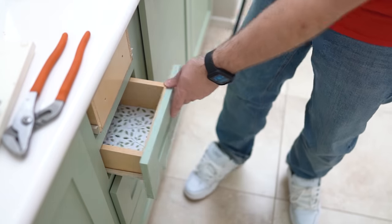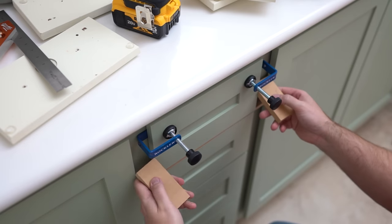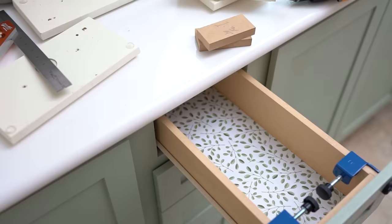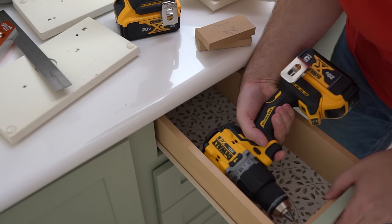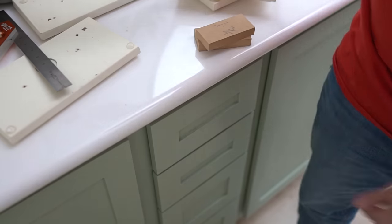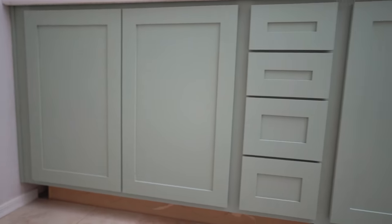Due to the adjustments you make on the cabinet doors, your drawers might not be absolutely perfect. The spacers were just a hair too tight — they'd still fit, but might remove a little paint. This is something you should anticipate. We're not perfect, and your cabinet carcass likely isn't either — there are all kinds of variables at play. I recommend just aligning the drawer faces vertically so they're on the same plane. It's really imperceptible to the human eye and 500 times better than what we started with.